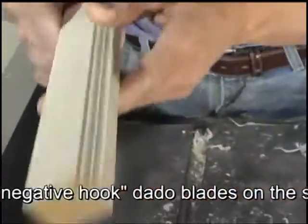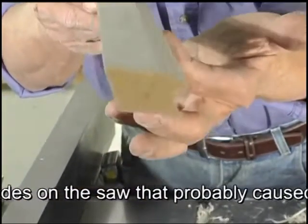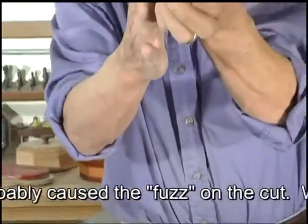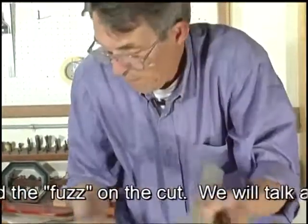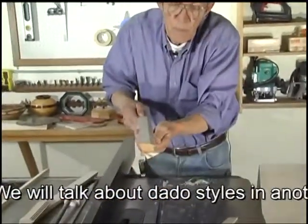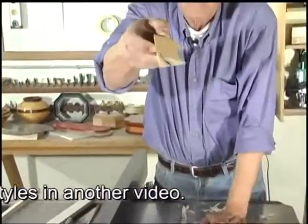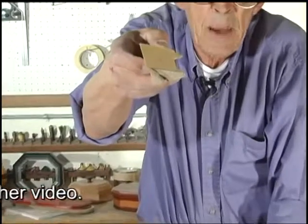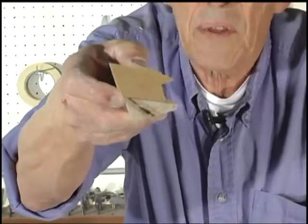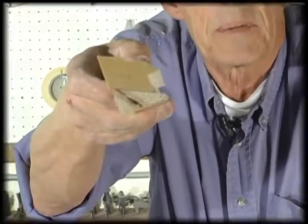And I don't know why that basswood fuzzes up like it does, but right there you'll notice how now the surface the picture sets against, the top of the rabbet, is now square to the edge of the material. And what that means is, when we set that molding on top of that wedge, everything's elevated to the angle it'll be at when the frame's assembled. And by doing this and going from one side to the other, we don't have to do any of the garbage most woodworkers do when they do compounds.